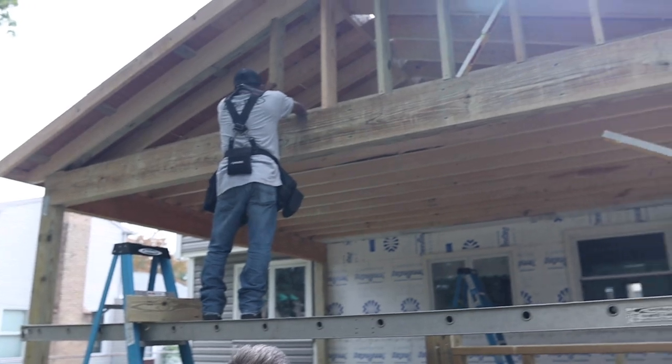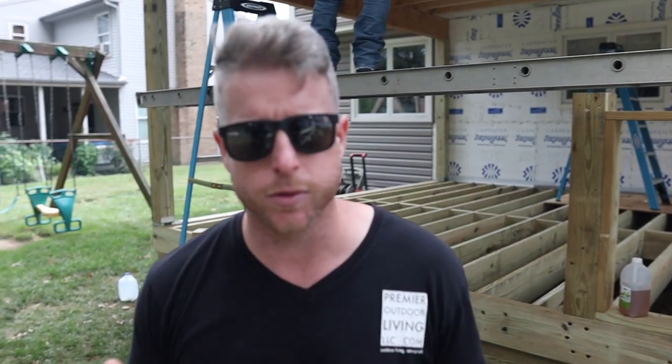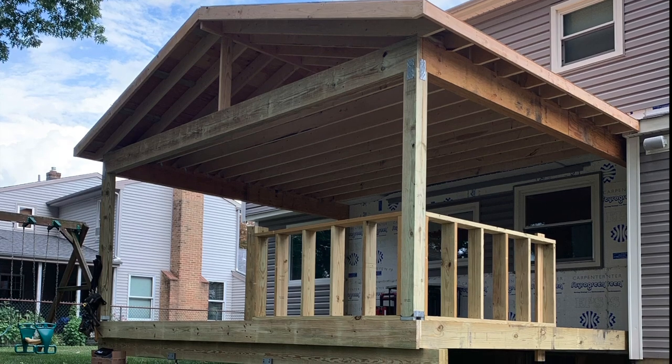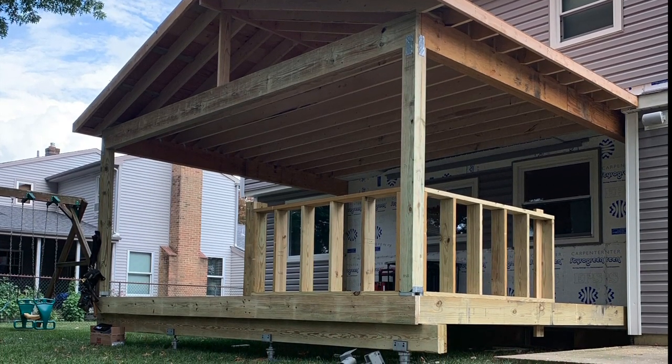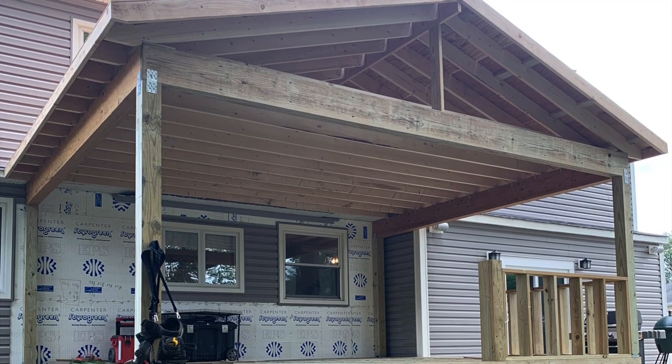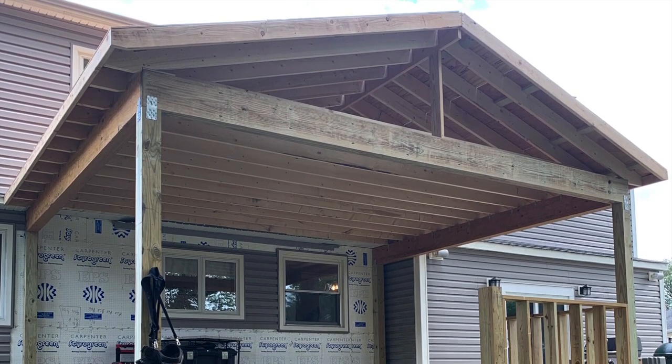One of the last things we're doing here to prep our frame is putting in our gable pins — using some 2x6s for that. We have a ledgestone tile veneer going on the outside of this gable wall, so the architect specced 2x6 gable pins along with some hardy board on the front of that. We'll be getting to that in the next video — some trim details, decking, and also starting up the patio. Make sure you hit subscribe, stay tuned, and until next time, this is Premier Outdoor Living.